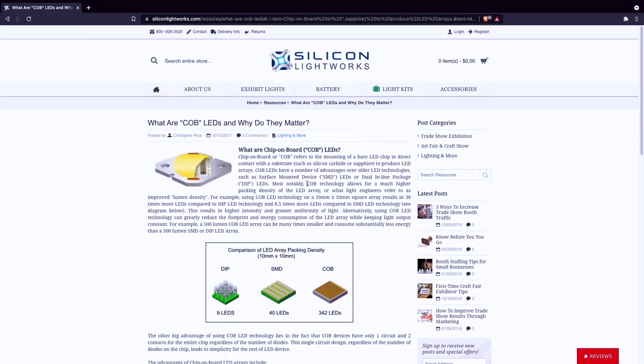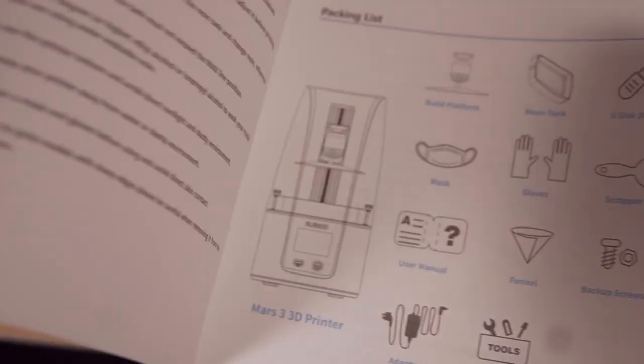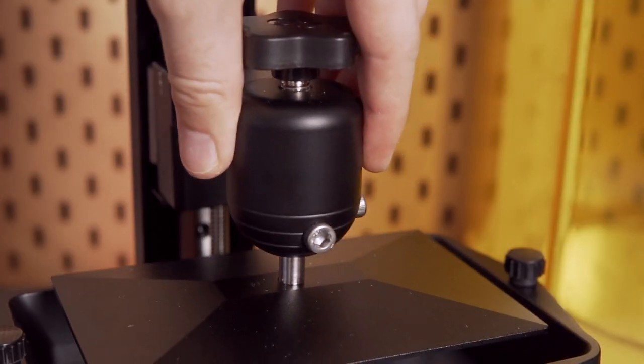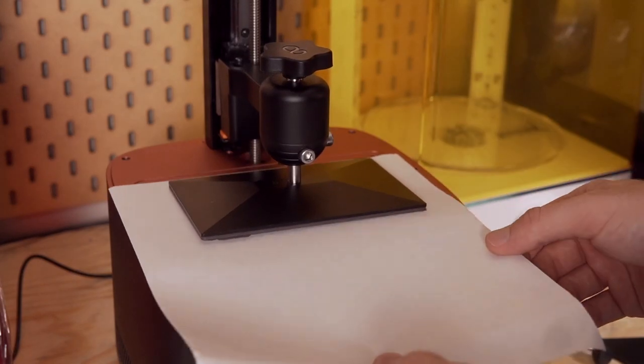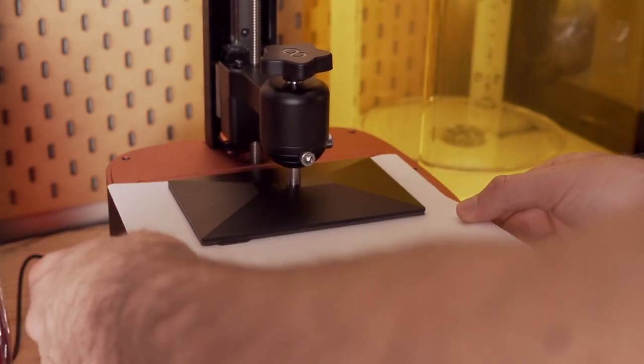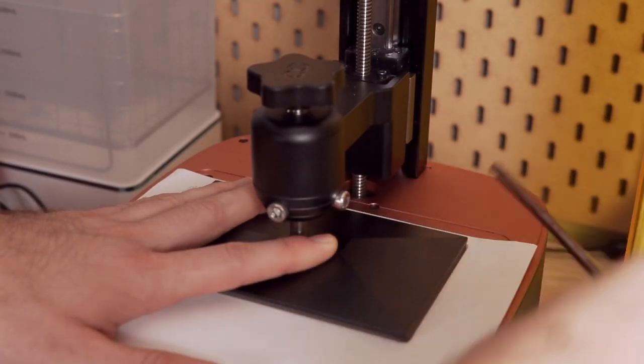The base is really only there to house the main board and other electronics. Lastly, the Mars 3 uses a new COB — chip on board — UV light source, which should be an improvement over the previous LED array that was already fantastic. Setup is identical to other Mars printers: attach the build plate, loosen the two ball head screws, place a piece of paper, home the printer, then tighten those two screws.